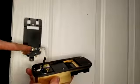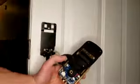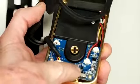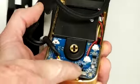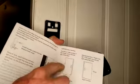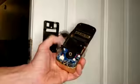Now insert your turn knob into the area right here. Before screwing on the interior portion to the bracket, if you lift up the weather seal — and the directions state this — there's a little switch knob right here. On the right it has an R, on the left it's an L for left. That identifies what type of door you have. Mine has the hinges on the left and the keypad on the right, so that's a left-handle door — flip that little switch to L if that's the case for you.